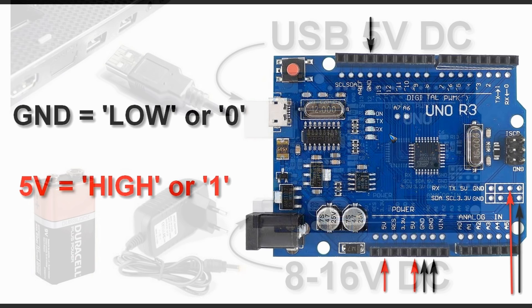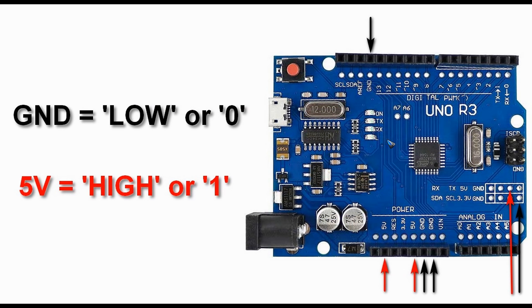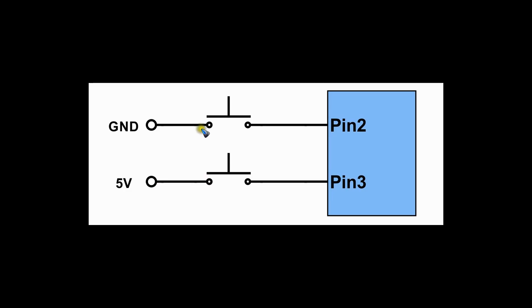That is why we need to use either 0 (ground) or 5V. Ground will be logically low in software and 5V will be our logic high. There are conveniently a couple of places on the board where we can connect ground or 5V to external equipment. We'll make the choice to connect our push button to ground and connect it to pin 2, and write the code for that.